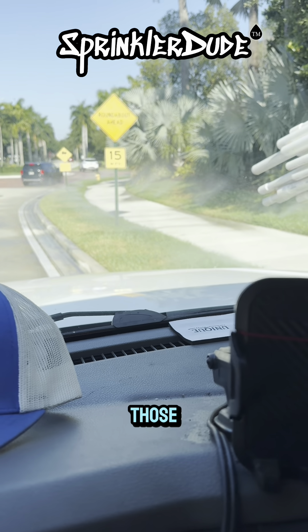Let me explain how to turn off the controller. You're going to hit the minus button until the time goes to zero. Now go back up until it goes to zero. Leave it — that's going to count down from 10 and then the zone will shut down. Just like that, we checked the one battery-operated controller zone. At some point in the future we're going to fix the wire so that we don't need the battery timer. The timer is set to automatic and not off, which is great because that area needs the water. Now we can turn on zone number seven and check that next.